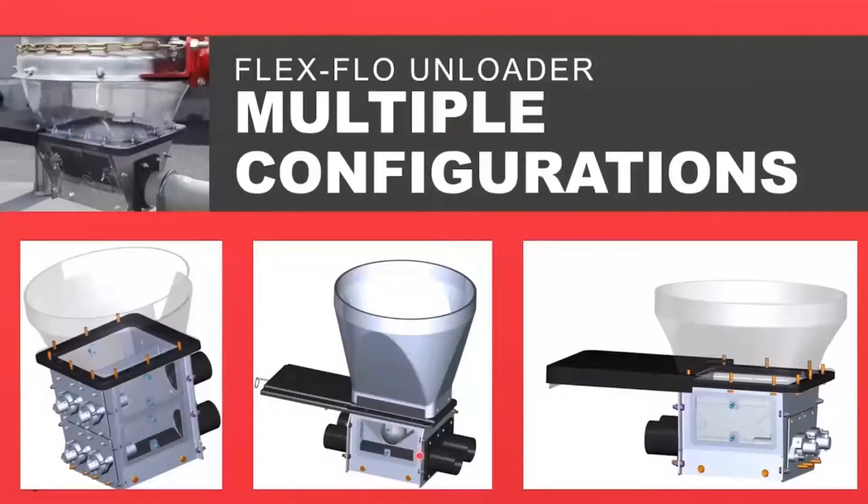This last slide gives a 360-degree view of the different configurations available. One noticeable difference is the anchor bearing system has changed to a bolt-on system, fastened directly to the unloader body — so we don't have to worry about muffler clamps getting loose and pushing the auger out the back of the bend. This also shows a legacy unload system with our current 16-inch clear, translucent, or black boot. We have a model that fits up exactly to that. And we've introduced the quad unloader — using the 75% increased opening — for applications needing up to four augers coming out of a bulk tank.